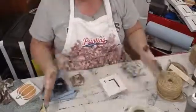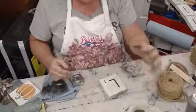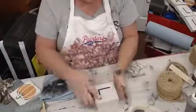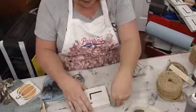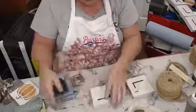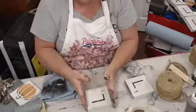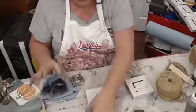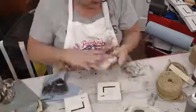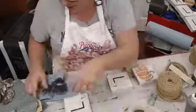And I used this chop saw and I put a clamp. So I cut my first one the size that I wanted it to be. Cut it. And then I put a clamp on my chop saw. So then every time I slid my board in, I knew every board was going to be exactly the same. If y'all want me to do a quick demo on how I did that, I can. If that doesn't explain it good enough, I'm happy to do that.